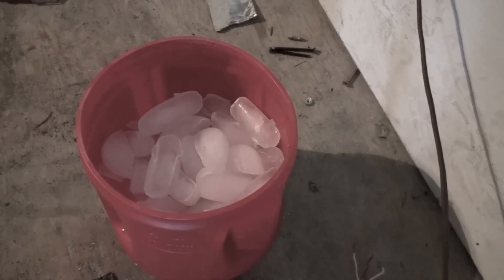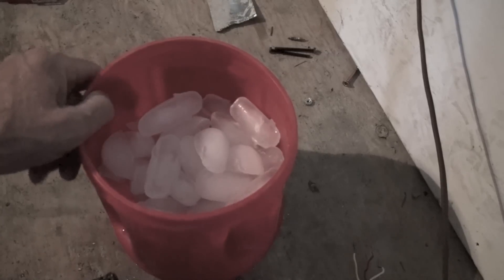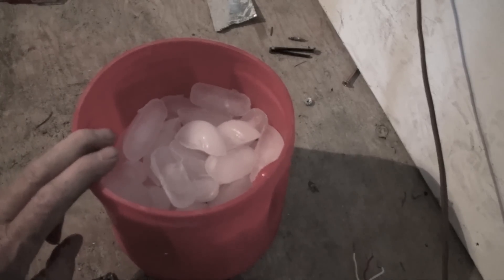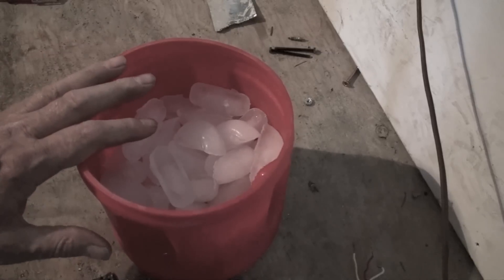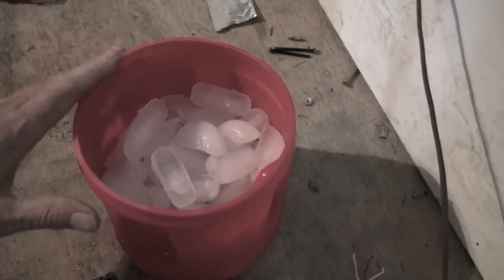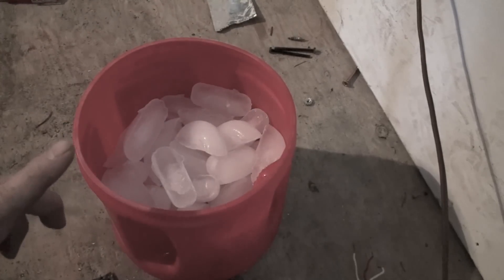Today is temperature calibrating day — we're going to calibrate some thermometers. I've got a can full of ice, but this is not going to work the way it is. It's going to have to be crushed. I don't want ice water — if you add too much water it gets to 35 or 38 degrees. I want it at 32.